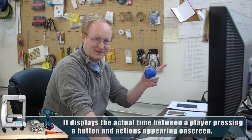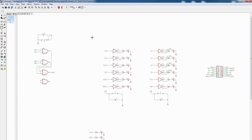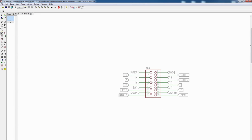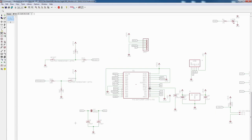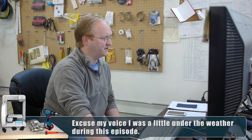Since I know this layout already works, it is a great basis for this new dev board. I'm going through the schematic and doing group deletes on everything that we don't actually need, and that will leave us with the bare essentials for a microcontroller dev board. All the board-specific stuff can go. What's left: the microcontroller, the regulator, the USB plug, the programming plug, reset and program button, and the crystal. There's our base system.